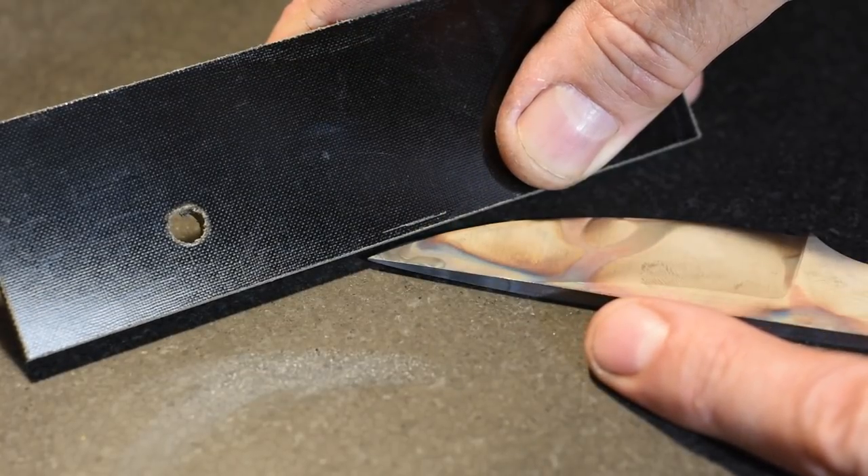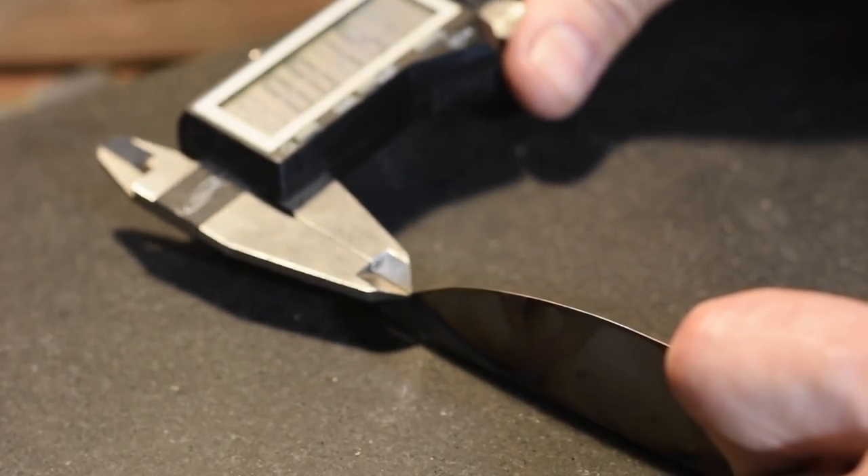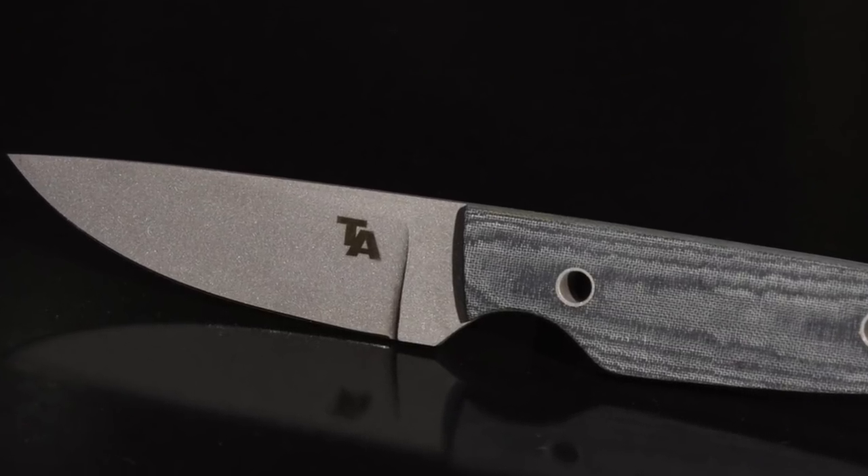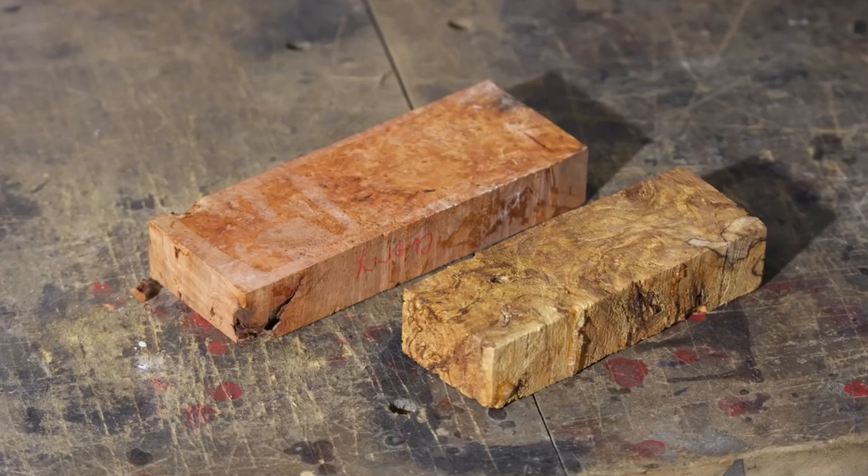What about the thickness of an edge? Personally I aim for around 15 thousandths of an inch, though it depends a little on the particular knife. I don't knock myself out making sure it's exactly 15 thousandths all the way along — I'm willing to allow a variation of one or two thousandths. And right back at the plunge line, it's always going to have to thicken out naturally. Sometimes that last half inch or so may expand by a couple thousandths of an inch, and I don't worry about that too much.